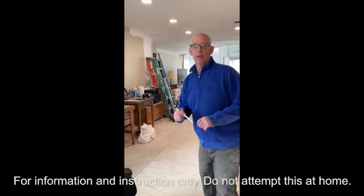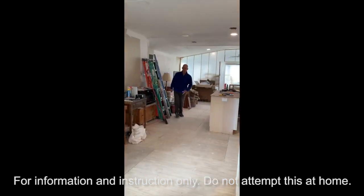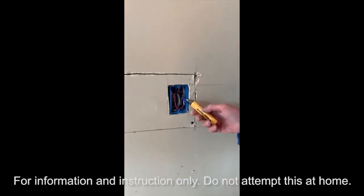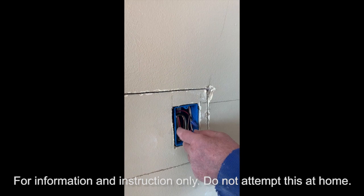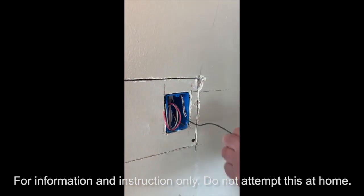The red beep means it's hot — don't touch the wire, it's not safe. I know it's circuit breaker number nine, so I'll go over and turn it off. Now it's off. The tester is dead — see, it's dead. Now we know it's safe to work on. Always verify there's no electricity before you stick your hand into the box.